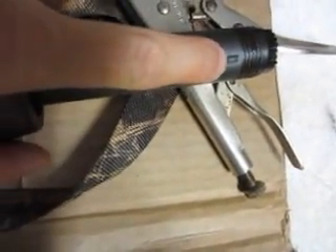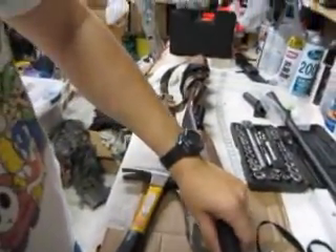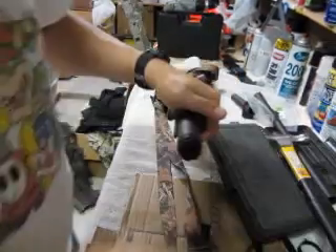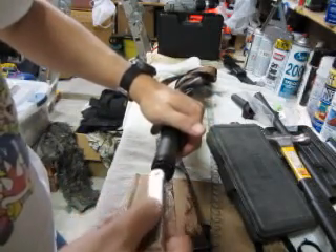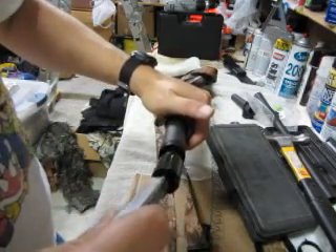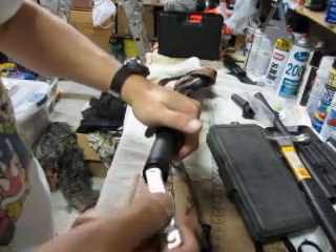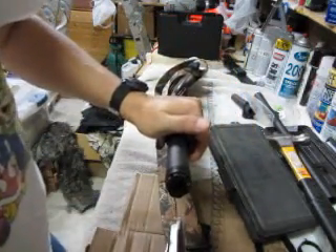That's the outside of the little dent that they put to retain this little end cap. And then here's the one on top up there. So I'm trying to tap those back out. If that doesn't work, then it's Mr. Dremel, and if I can't get it out with the Dremel, then I'll have to drill those things out. I do know that to get this out, you get some kind of straight slot, push that little carrier in, turn it 90 degrees, and it will come out. I'm putting it in there to know when I've pushed those little indentions out far enough.